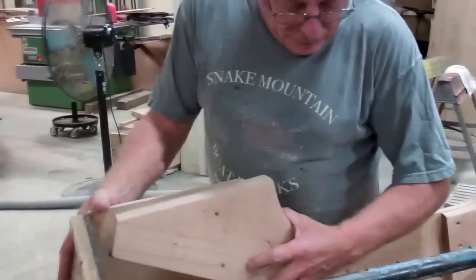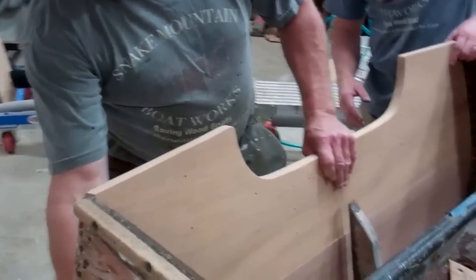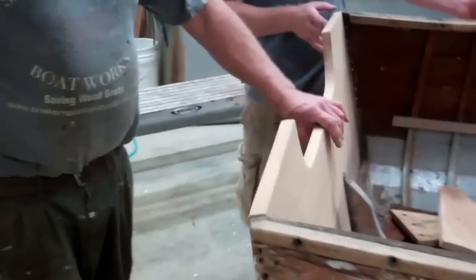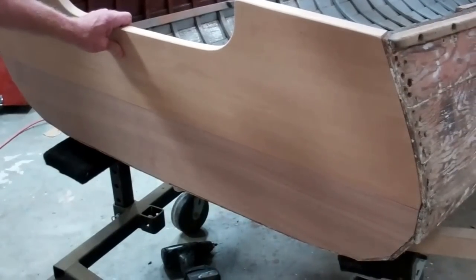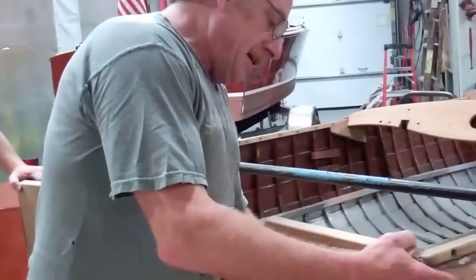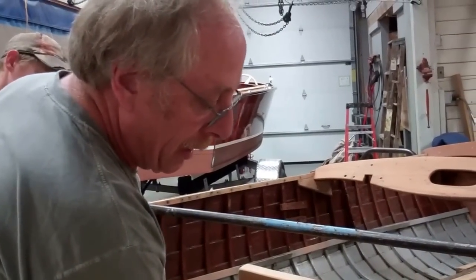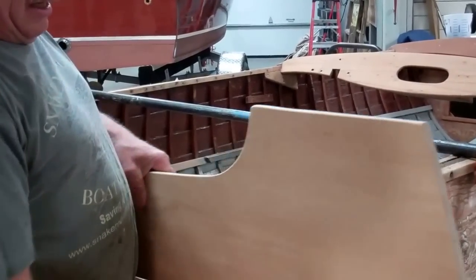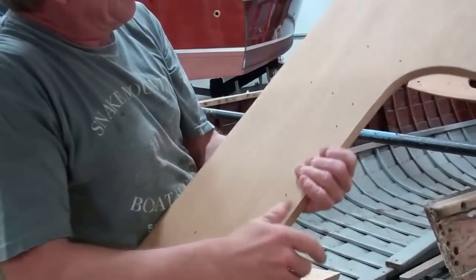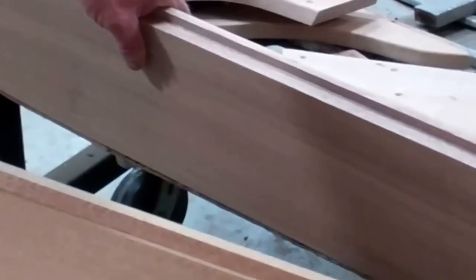We made a new transom blank. The old transom had an extra-wide, inch-wide seam in it, so I cut out a new transom blank for it. We're working on sanding things up, sealing it, and getting a finish on them so we can put varnish on the insides before putting it back together, because the inside of this needs to be varnished. Now the seam — the old one only appeared to be like a quarter-inch shiplap, so this one I put half-inch to five-eighths shiplap. I do believe it's going to be a much better seal than the old transom.